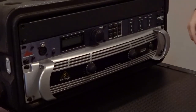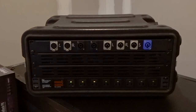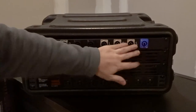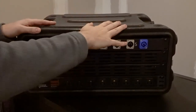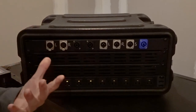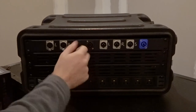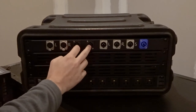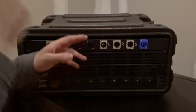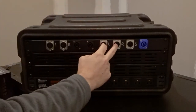So let's spin this around real quick. We'll take a look at the back and I'll show you a little bit how that's hooked up. So here on the back we have everything sealed up - all nice and clean, no wires coming in or out. We have our PowerCon input here, which is a standard PowerCon cable that powers everything in the rack and it also puts power to this distribution bus down here. And then I have a left right input here, and I have both of my subwoofer outputs - these are the twist lock connectors for the subwoofer outputs.